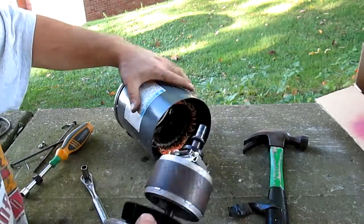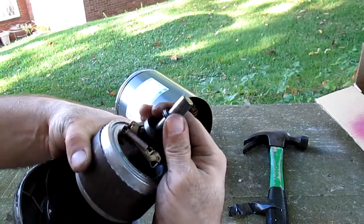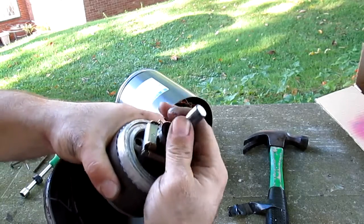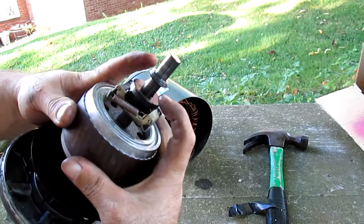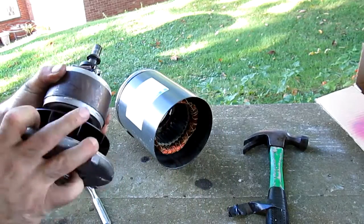The first thing you do is you carefully pull the shaft up. Some other blower motors have a keeper ring that snaps into a groove on here. This is a pressed-fit bushing, in place — didn't move. The centrifugal switch is right where it is. You can see the wear marks. Everything's all fine and dandy on this.